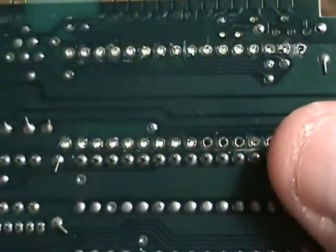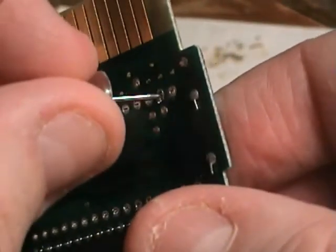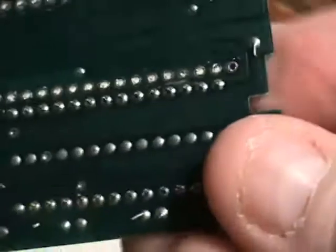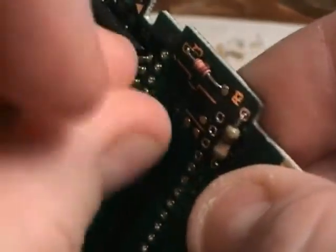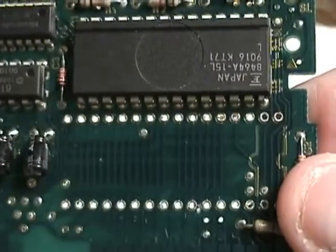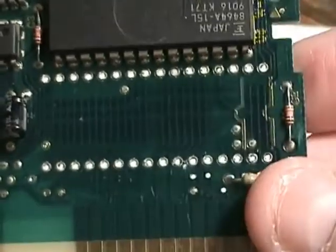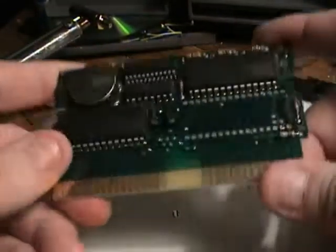It's not like you can fix these things — if you can, I don't know how to do it. You just go around with your thumbtack and kind of open up all your holes a little bit, just check all your holes and open them up. When you put your new chip in — sometimes when you open up the hole you don't even have to scrape it off if it's wide enough, you just kind of push the solder away. Solder's really malleable, so it bends — it's a really soft material. So you have an SN-ROM that is ready to get a new wired-up chip with a new game in it.